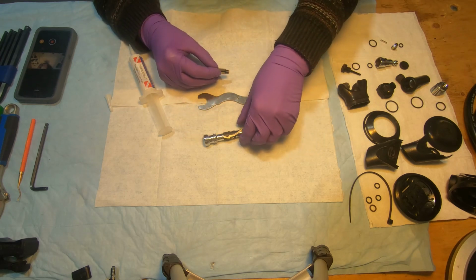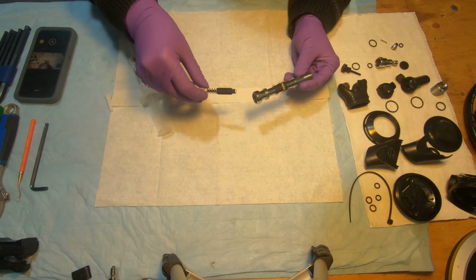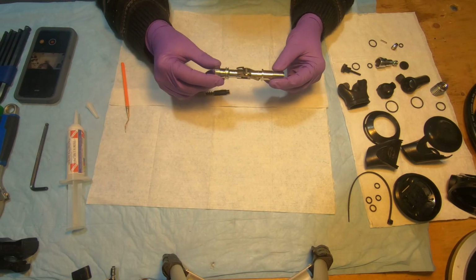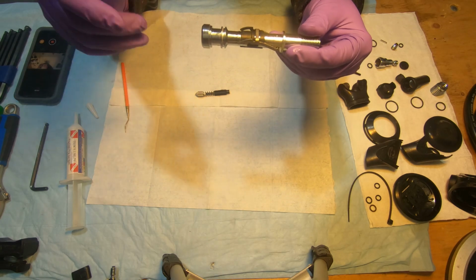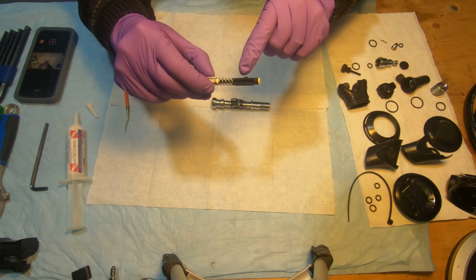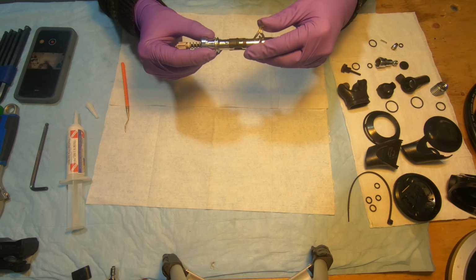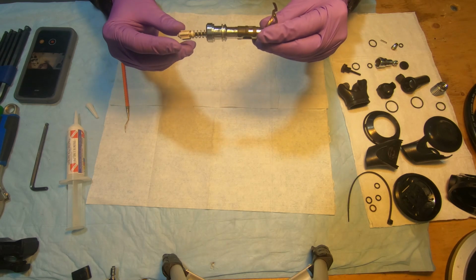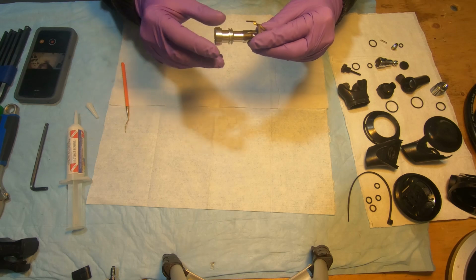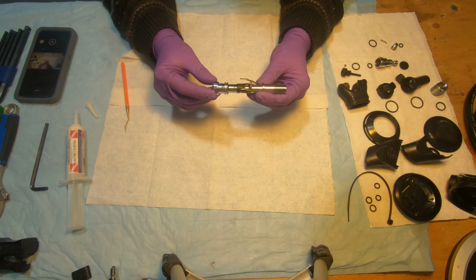So then we're supposed to insert that whole assembly in the barrel. If you notice here, with the demand lever facing up, insert your poppet with these little fins that stick down here from both sides, facing down away from the lever. While you're inserting it, place the lever up all the way. Use your finger to push it through. And now when the lever is in a working position, it will catch the whole poppet assembly inside.